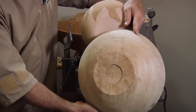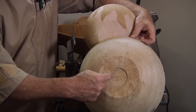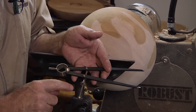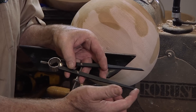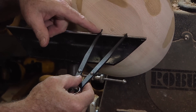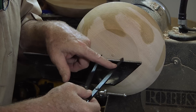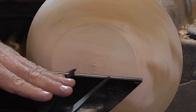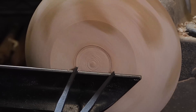I'm going to make a recess about this size — that's plenty for bowls 14 to maybe 16 inches; beyond that it starts getting a little bit iffy. First I want to mark the diameter, then do my plunge cuts and clean it out. This is a compass — it's a dedicated tool, super glued into place. If you don't super glue it, use it three, four, five times and you'll notice it's about a quarter of an inch bigger on the end. Turn the lathe on; I'll mark narrower than I have to be and work my way out. Do take care not to touch the spinning side, because if you do it'll flip over and turns the thing into a pretzel.